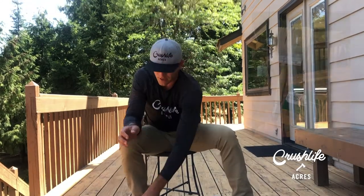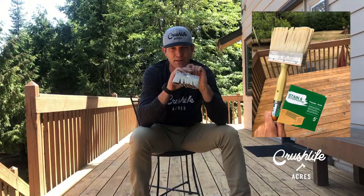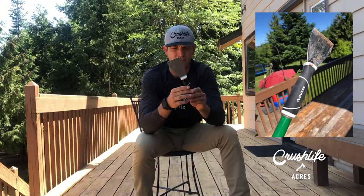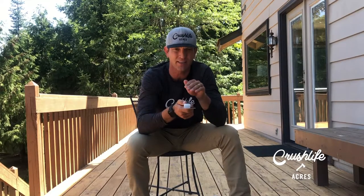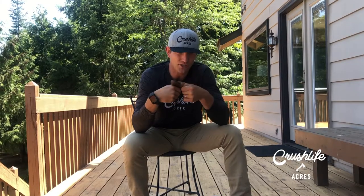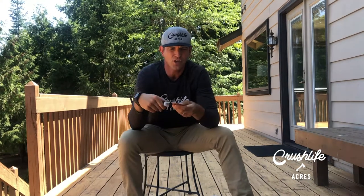The way I would do it is paint it on with a deck brush — I kept the stripper in an aluminum pan you'd use for barbecuing — and then scrape it with my Husky scraper, which also connects to a broom handle. I found the best way was actually to be down on your hands and knees so you could really get a lot of torque behind the scraper. I would paint it on, scrape as much as I could, paint it on again, scrape again — sometimes doing it a third or even fourth time on each section. For boards that had bowed in the middle, I'd angle the scraper to dig down in. And what was nice is the scraper isn't super sharp, so even going across the grain, I wasn't ripping the grain up too much — I was really just getting the paint off.